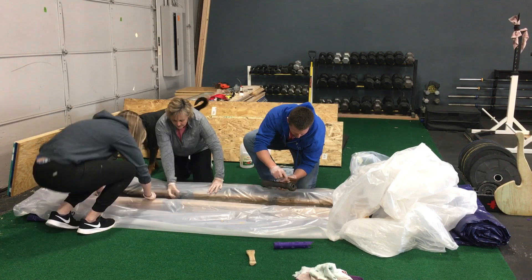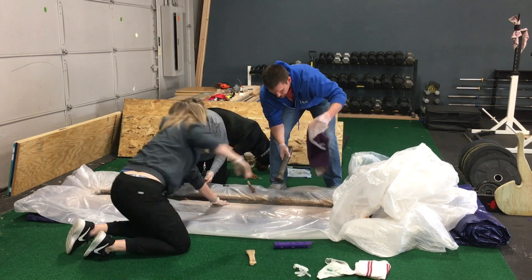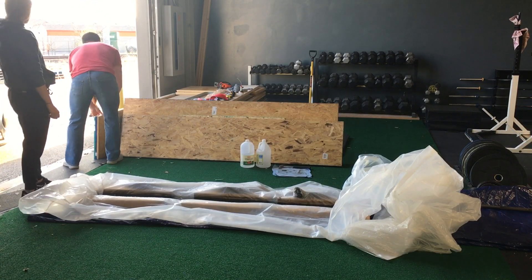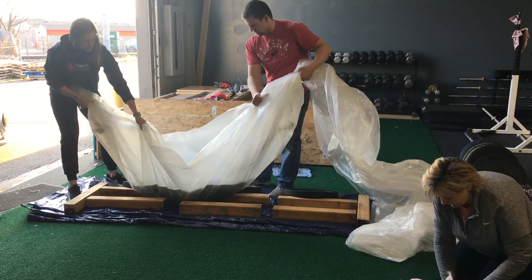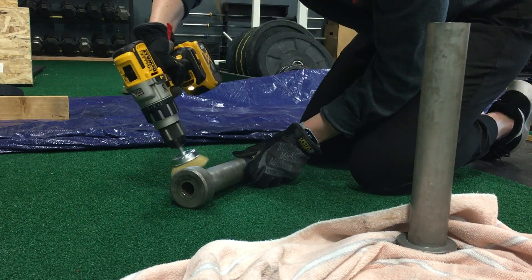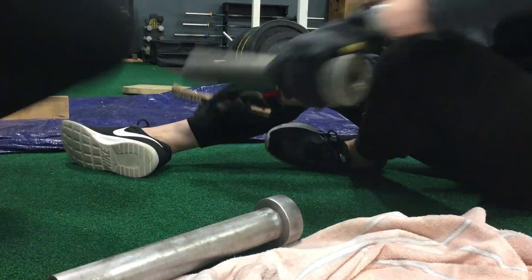Now the fun part begins. Becky, Barb, and I are brushing everything down with some wire bristle brushes. The next part is not on camera because it's not particularly exciting, but we rinsed everything down — we actually used one of the showers at the gym. Important side note: make sure you've got a plan ahead of time to get rid of that vinegar water bath liquid; it's gonna be real nasty with a whole bunch of rust in there. After rinsing, we sprayed everything down with a water and baking soda mixture. The idea is to neutralize any acid from the vinegar and prevent any flash rusting. I don't actually know if that step was necessary, but we didn't get any flash rusting so I don't regret doing it.